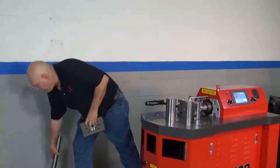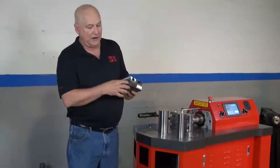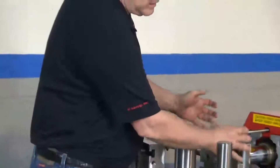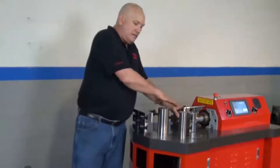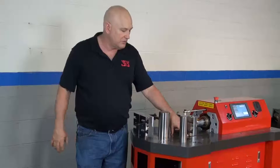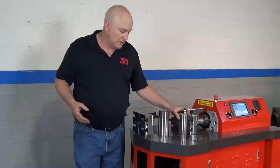On the bottom of the wear block, we have holes where the leveler pads ride. It's a special alloy that never needs lubricating. With the leveler bolts up here, you can basically level the head out, which prevents a cocking motion. The head is about a millimeter and a half — about 50 thou — above the table. Without that, you would be able to cock it.